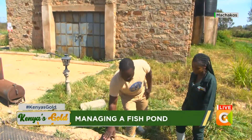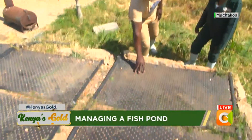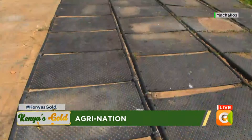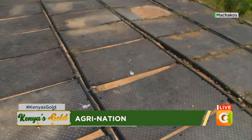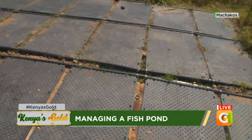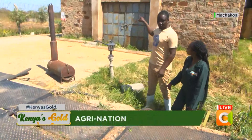It floods this panel, and when this panel is full it starts flooding the next one. We go all around to the last panel on this row, then come back on the second row. The water exiting the two panel rows comes out here — this is the exit pipe, the outlet from the solar system, which takes the warm water back to the fish.